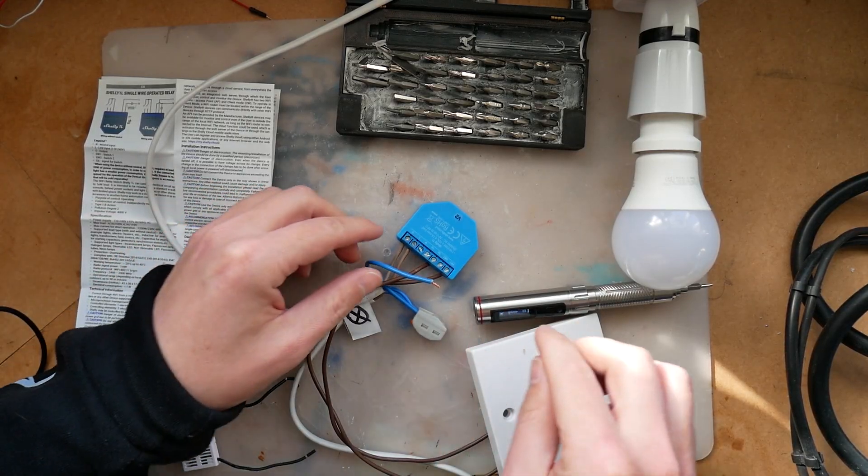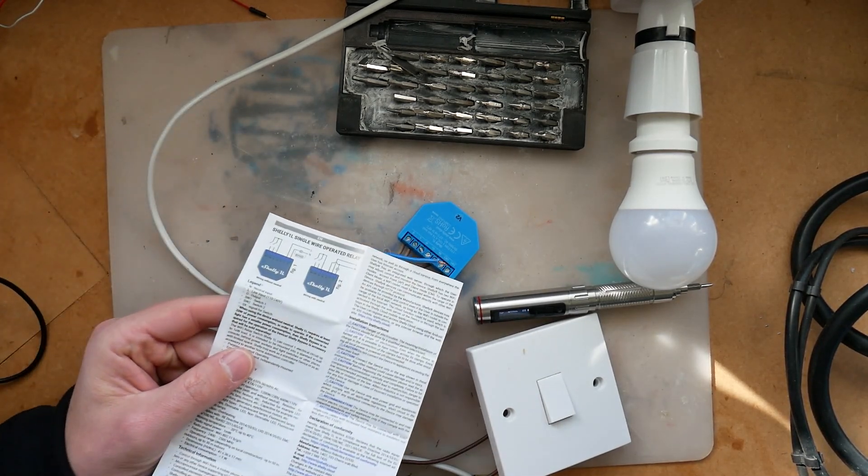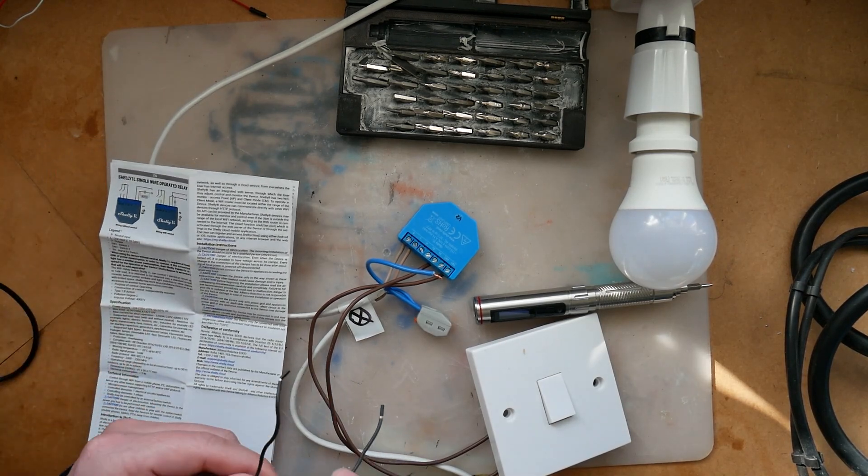If you're living in a country that supports live and neutral, the use case is pretty straightforward: watch the labeling, connect the switch, and you're off to the races. However, if you're in the UK or any country with only a non-neutral setup, you'll have a couple of limitations. First, you can only use Shelly as-is in a non-neutral setting if the load on the switch is more than 20 watts. Considering average light bulbs consume about 8 to 10 watts, you'll likely hit this scenario with a candelabra or something with multiple light sources.